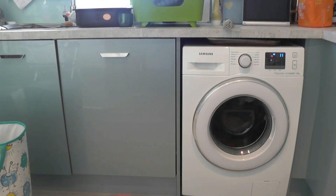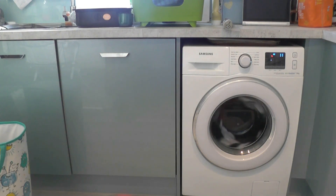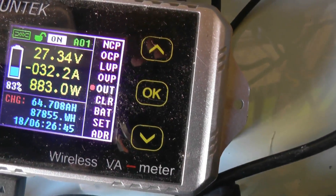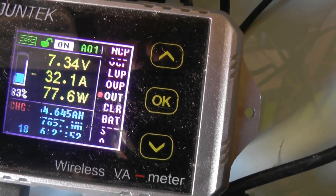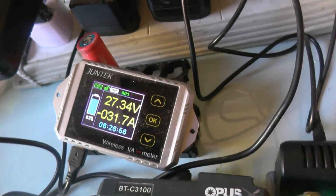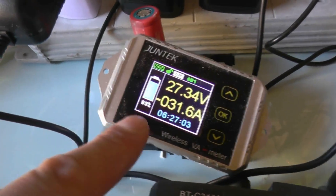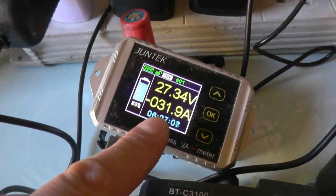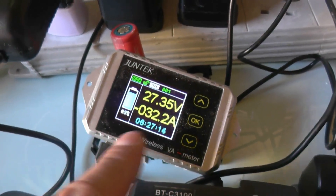I know the dishwasher is just fine on this unit. I'm going to wait for the dishwasher to finish — I believe it's not far off — and we're going to see how much power was drawn. We started off at 86,051 watt hours and finished at a total of 87,855 watt hours. So 1.8 kilowatts drawn out for the washing machine and dishwasher cycle — the washing machine probably used a few more watts on grid just to spin the last bit of water out. But I'm happy with that. Now we're putting 31.6 amps back into the battery, so hopefully I'll still have enough excess power today, mid-September, to heat some water for a wash or bath later.